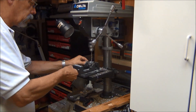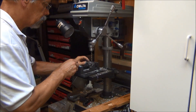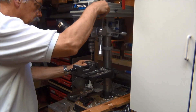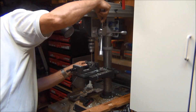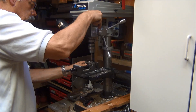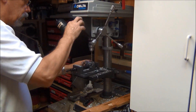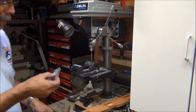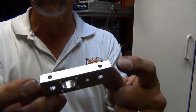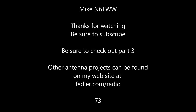There's one, there's another one — drilling the holes. I'm going to add a little bit more oil. And there's two. Next thing I'm going to do is go ahead and move over to the vise and put some threads with a tap in those holes. There's the fixture, there's the two holes I just drilled, and we'll put some threads in there with a tap.